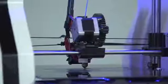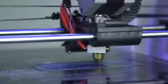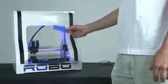For each print you start, make sure you watch the first layer. If the print bed has been prepared correctly and the 3-point leveling procedure has been used, your first layer should look perfect. If you notice small imperfections such as a filament sticking up or small clumps of filament randomly scattered across the layer, then let the print continue. These won't be noticeable once the next layer or two is laid on top of this first layer. Congratulations on your first print. If there are any major problems with your first print, please refer to the troubleshooting section of this video guide.